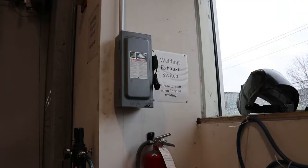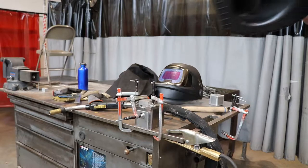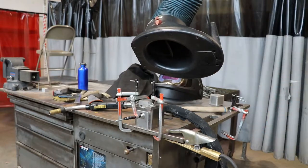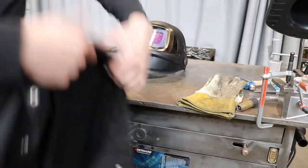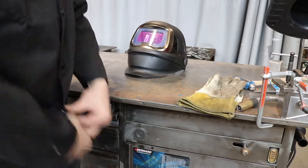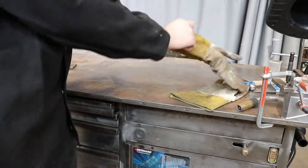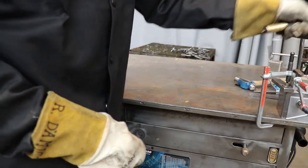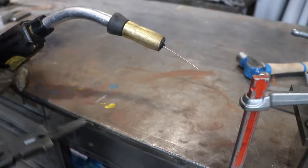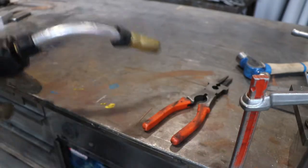Once all that's good, you may want to turn the exhaust on — good idea to get rid of any welding fumes. The switch is located over by the window. Bring over one of these fume extraction hoods and make sure the louver is set to pull the gases out — about a foot or so away is fine. Get on one of these welding shirts; this is a cotton welding shirt for the light duty work we're doing. Don your welding hat or mask — this is an auto-darkening mask — and some lighter MIG welder gloves. The welding pliers are usually stationed over on the wall by the charts and are great for trimming the wire.